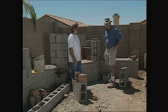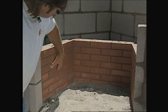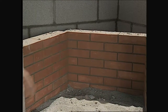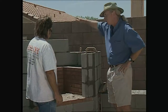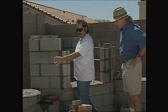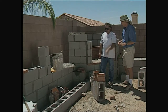This is Bill Mitchell with R&B Masonry — they're doing the masonry for our job here. What do you got going here? We've got a red brick firebox using Phoenix Brickyard's two-inch red pavers. They want that old look, so we're raking and striking the joints out deep to give it that old look. On the outside, we're going to have a concrete casting that goes around the front for a nice classic look, and the chimney continues on up above the wall. Now, this over here is the barbecue — we've got the unit that will slide in, and it radiuses out at the end. There'll be a bar top on top that rolls out four feet with a two-foot radius coming around, stepping up a little higher — kind of a stand-up bar.